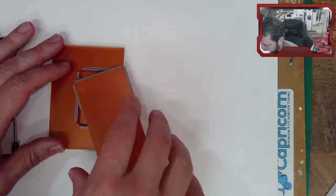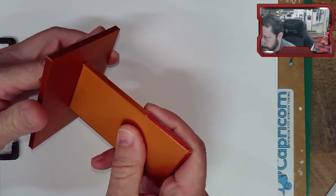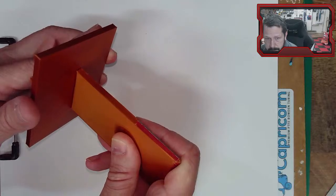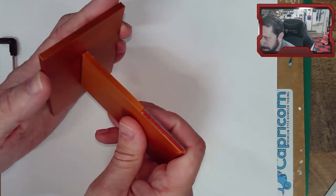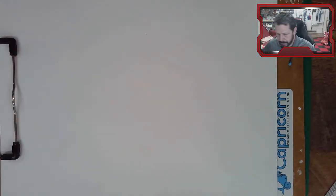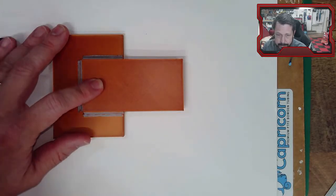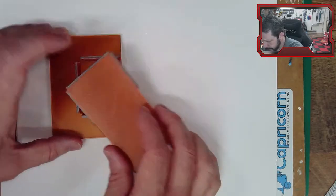The second case we'll do is bending — like a little cantilever piece welded to a wall with a point load on the end, which would pop it off. We'll do both of those today. The torsion one is a little more involved with some new calculations, while the bending one is relatively straightforward — your book barely has a full page on it.